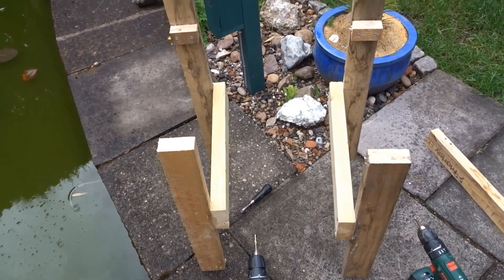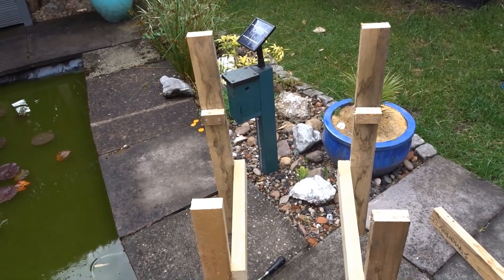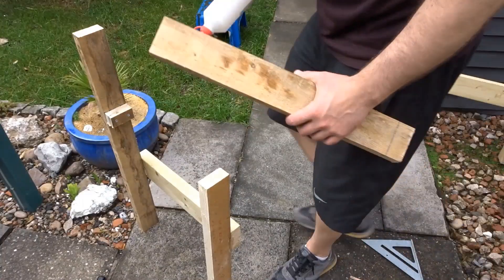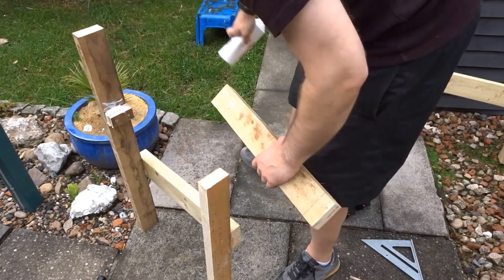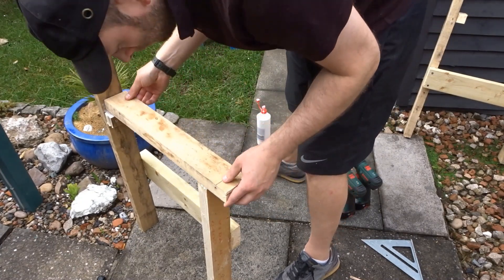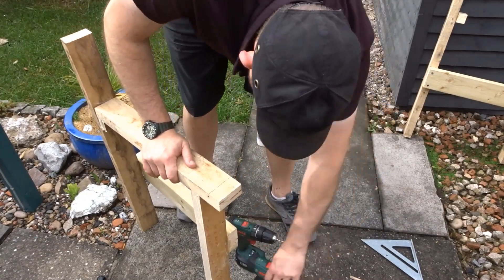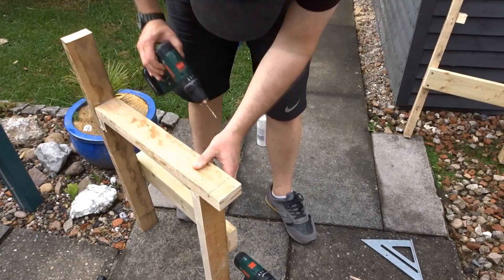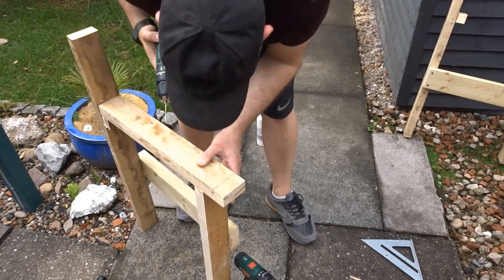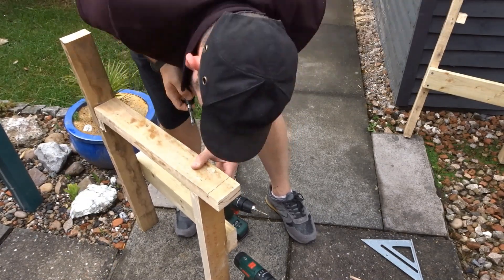So that was the frame so far — I just need to add those armrests. As you can see, those supporting blocks help to support the back of the armrest and line it up with the front, so it's much easier to assemble. Because your arms go on there, I wanted the screws to sit flush, so I just countersunk them.